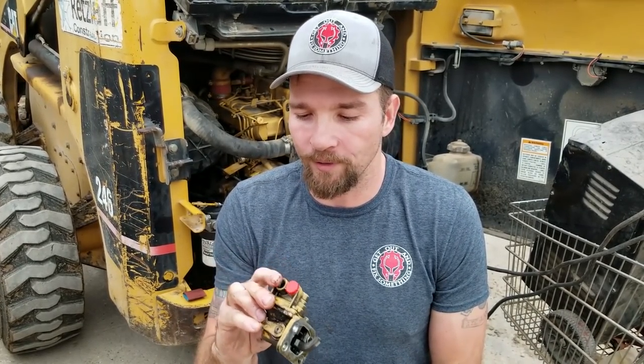The fuel pump is extremely easy to take out. The only issue was getting to the bolts — they're a little hectic to get to — and scraping the gasket off. Somebody glued the gasket to the block, probably at the factory. I probably could have gotten away with reusing it, but I don't like to do that on a customer's job. I'd rather spend the time to scrape the gasket, put a brand new gasket with silicone and sealing, and do everything I could. If I leave the old gasket on and it leaks, I can't really defend that to the customer.